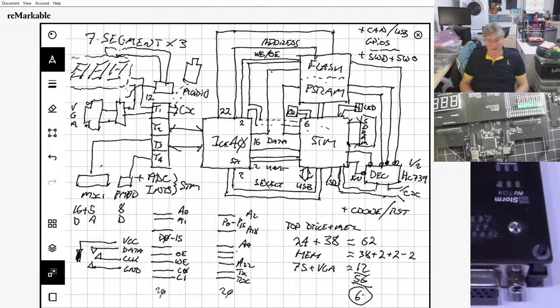Okay, so into the finer print then, Laurie, and everyone else for that matter. Let's also imagine the ILB now, which is now a four-tile board with a narrow mezzanine. Let's think about the other configurations. In the other configuration, you might have the hyperbus mezzanine. That may have, I'll probably put a FPC camera connector on it, or a display connector. And then you can put whatever tiles you want with that.